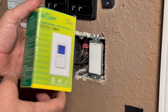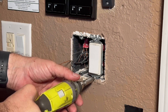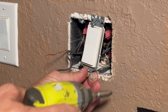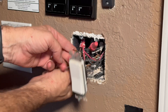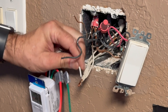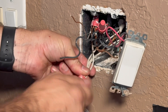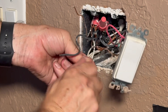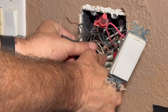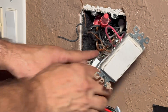This is an astronomical timer — I've got this listed in the description below the video. Now this is my garage light switch and I'm removing it to access the white wires, or neutral wires. Now I'm coming in with the timer. This is the white wire and I'm connecting it.